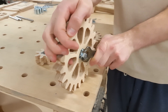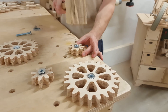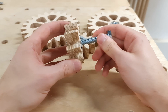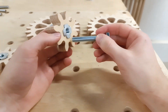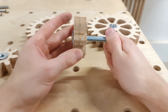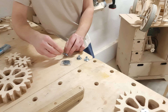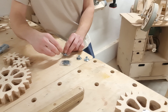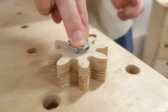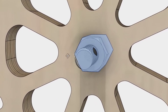That didn't work, so I ended up hammering all the nuts in place. The problem was that none of the nut threads lined up, so we couldn't install the gears to the axis. I could probably realign the nuts and threads by hammering them deeper or pulling them out a little, but it seemed too complicated — since one of the goals for the go-kart project was to make it easy to replicate. The T-nut approach has a huge potential for going wrong and wasting material. With that in mind, it was time to test out the long hex nut approach.